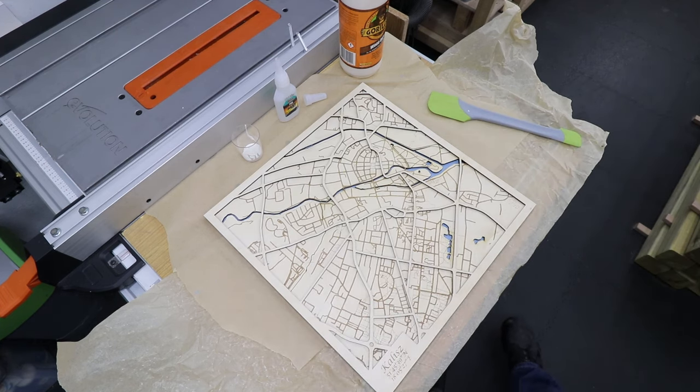This step is a bit of an afterthought — I decided the frame would look a lot better if it was black, so I'm applying some wood stain. In total I'm going for three coats with light sanding in between. As a finish I'm going to use spray varnish — three coats with sanding in between the coats. It's just the easiest finish to apply, especially given the nature of this project.